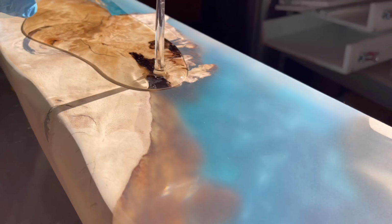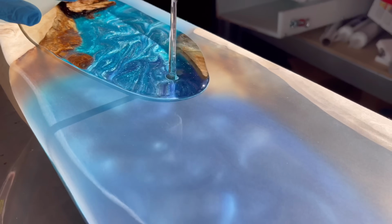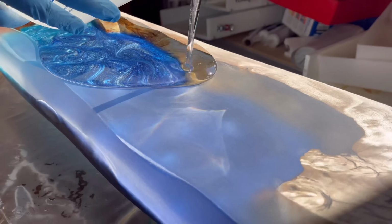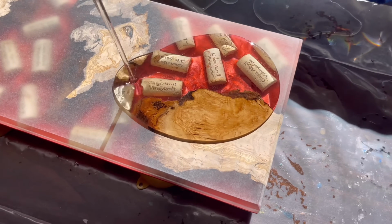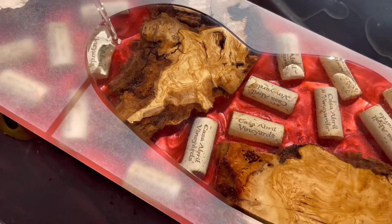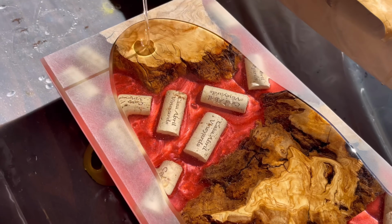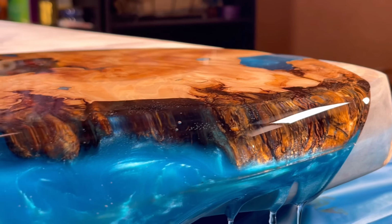It's always good to elevate whatever you're going to be pouring tabletop on. We just showed you some painter's pyramids. Those are perfect for perching your piece up. That way they're not touching flush with whatever you're gonna pour your tabletop epoxy over. This keeps them raised and elevated. That way you can get a good overflow of your flood coat and make sure that you get the sides to it and everything comes out kosher, folks.